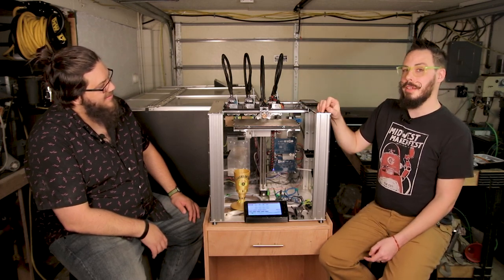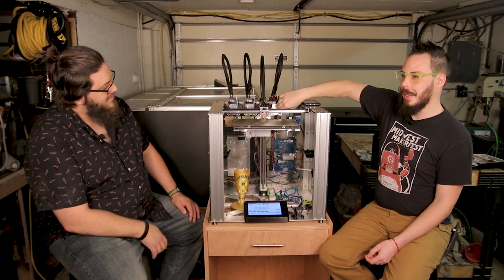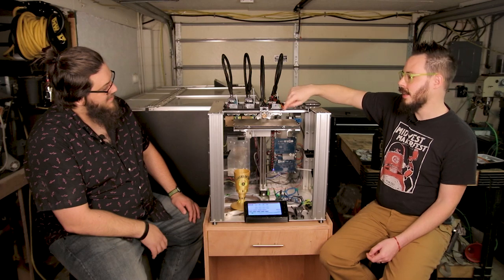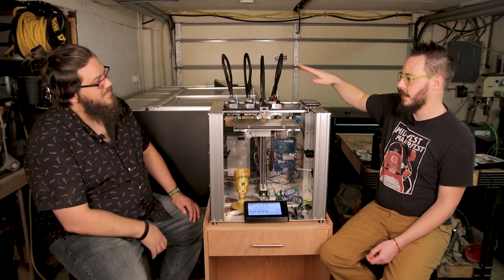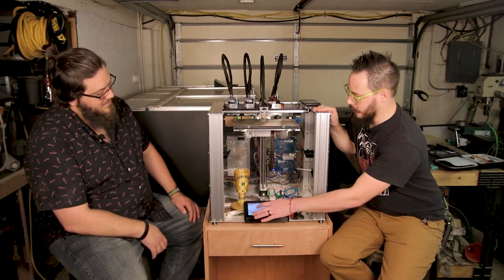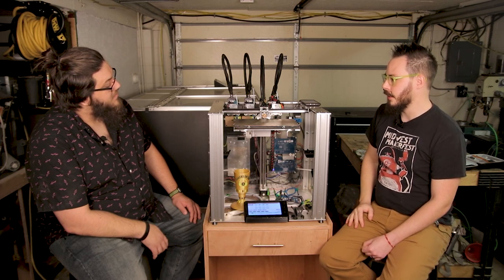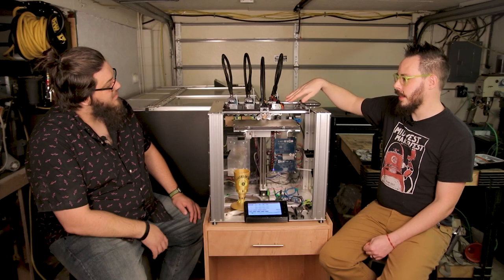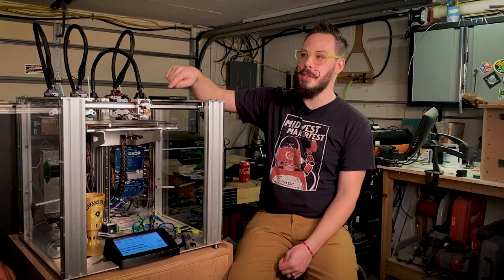And we can do that because there's nothing actually hard mounted with the tools, so the tool length doesn't matter. This pin or probe's position always stays constant. Let me just home the machine real quick so you guys can see the switch in action. All of our tool lengths are set from that switch position. That switch position is Z0.